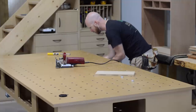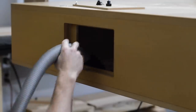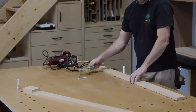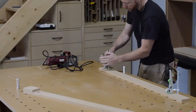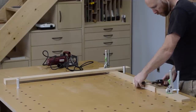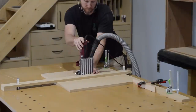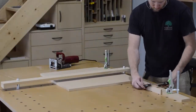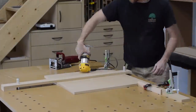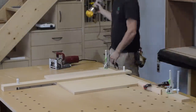Putting the hose away is equally as easy as taking it out. My plan for cleanup is to clean the filter as I would any other filter and then clean the dust out with a dedicated vacuum I use for cleaning up the shop. Here's a demonstration of how I plan to use the 90-degree pattern of holes. With two fences clamped in place using the PARF guide system to drill two holes, I can clamp a stop block and route a dado, use a biscuit joiner, and so on — repeatedly. After a few test cuts I was really pleased. It's very accurate and really easy to set up. I also ordered the dust collection shroud for this router, so setting up and cutting joinery in the middle of a panel will now be quick and easy.